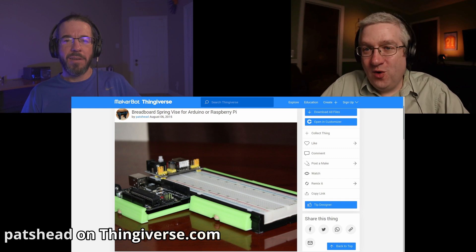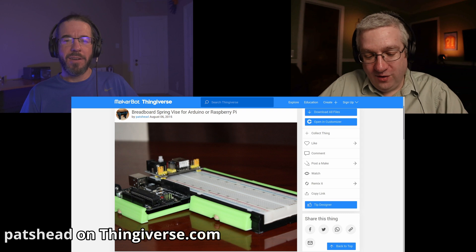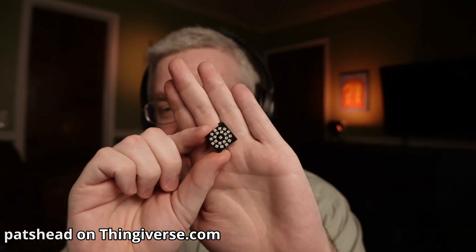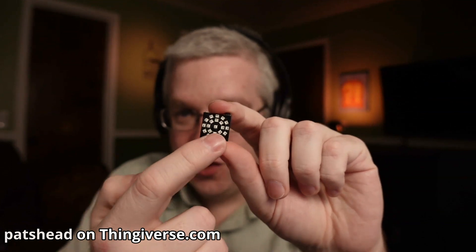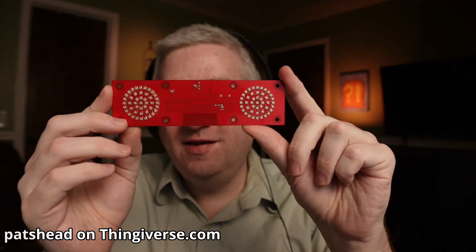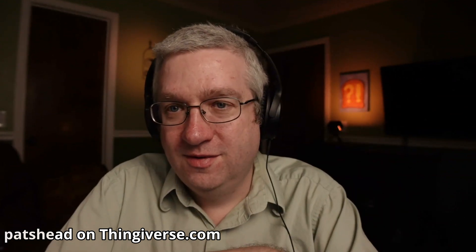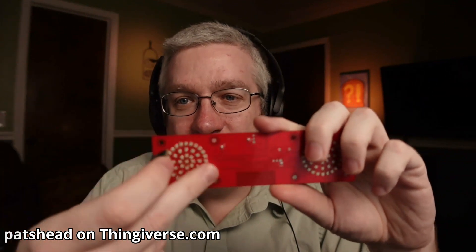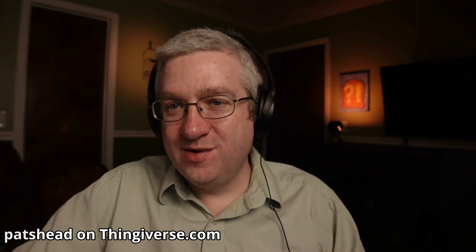This is one of my old designs — it says it's from 2015 — and I was using it this week. I've been using it because we ordered some of these tiny little Uber lights boards. These are RGB LED boards — it's tiny, just over a gram, and it has 21 LEDs in three concentric circles. Our big Uber lights boards aren't ready for production yet because you can't get enough LEDs or ESP boards to sell them. But we condensed it down — same pattern as the big Uber lights but with one ring deleted, compressed down so it fits the size of a key on your keyboard.